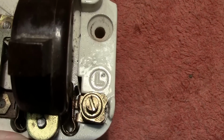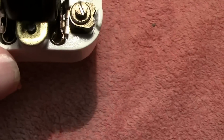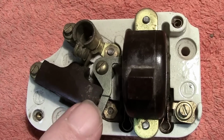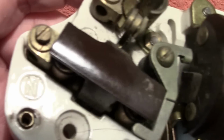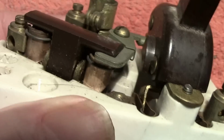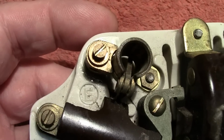You've also got on where the wires go, that's your live, which goes through the switch. The other side of the switch goes to the other pin under there, to connect across. And on the other side, your neutral terminates in there, and you've got earth, which is the large pin.